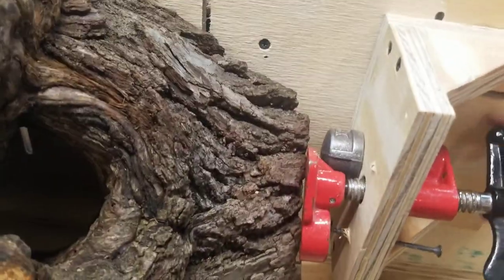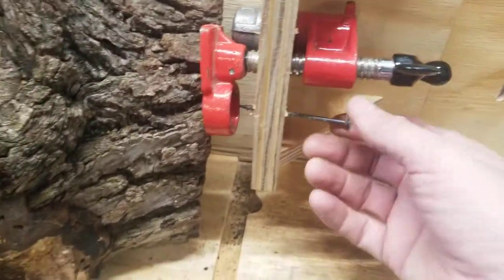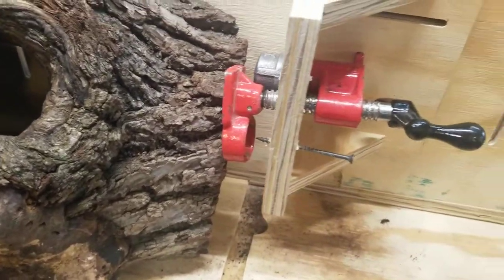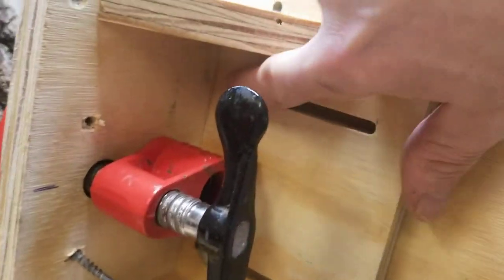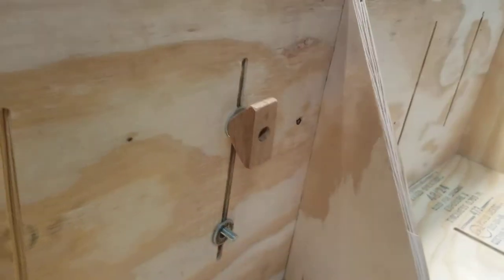You can see I've capped off the pipe clamp and there's a screw — I learned it's nice to drive a screw into the end grain and then tighten it, and that keeps it from rotating on me. These pan head bolts that you can see up in here — if I can turn this and come around to the side — this slides up and down based on these, so you loosen these and raise the whole carriage up and down.